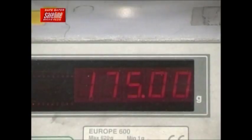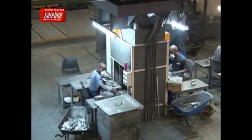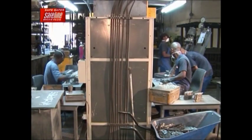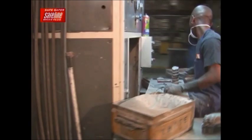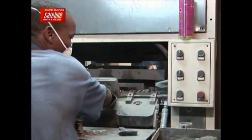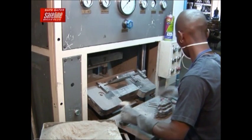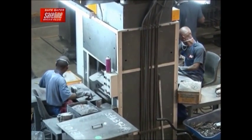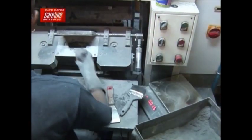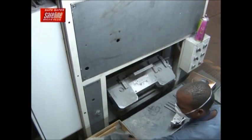The compound is then weighed out and pressed onto the backing plate in a cold press. Due to the huge demand on SafeLine aftermarket pads, we have designed and have a patent pending for the world's first double-swing press. The new press has enabled us to double our output. The system uses a cantilever that is recessed 1.5 meters into the ground and comprises two sets of tools for the one press. This facilitates two operators on the machine — while one operator's pad is being pressed, it allows the second operator to load another pad. Once pressed, the machine swings to the second operator and the process is repeated.